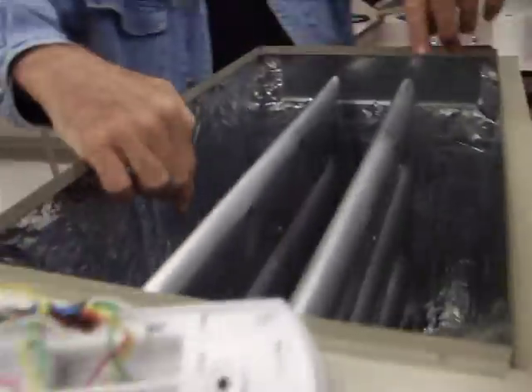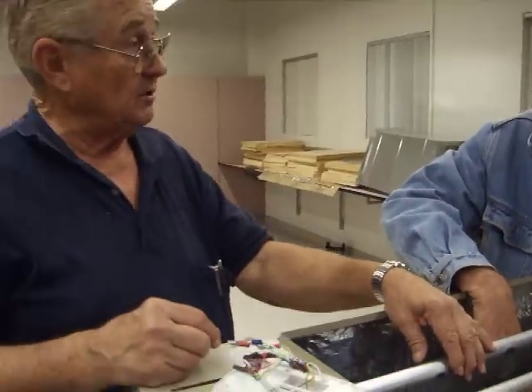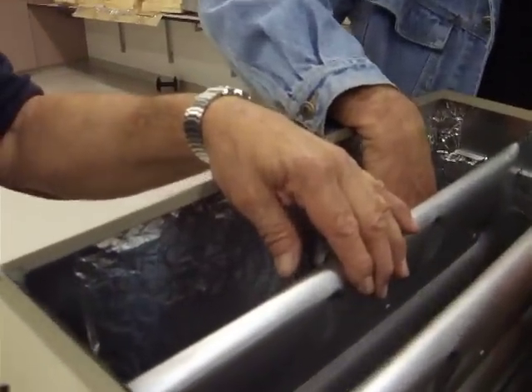The two all the way down to the bottom are also sensors for the blower motor and for heat. If we got a cracked heat exchanger and we were blowing heat down, then they would sense that and shut off. If the blower's not running, they would still sense heat anyway, wouldn't they?